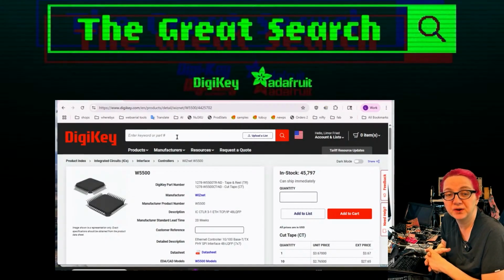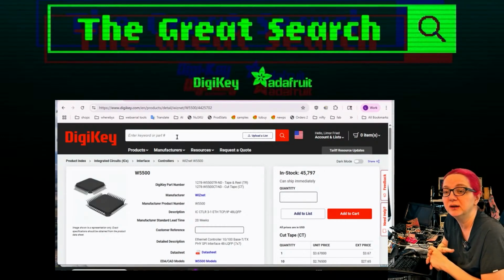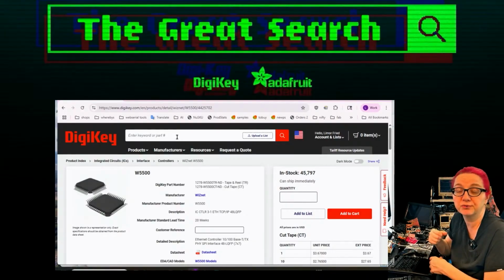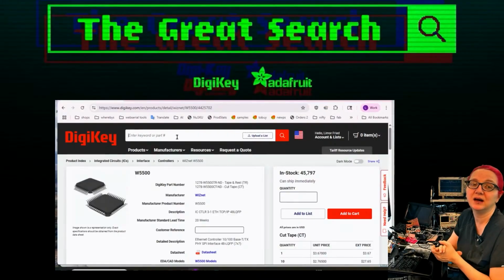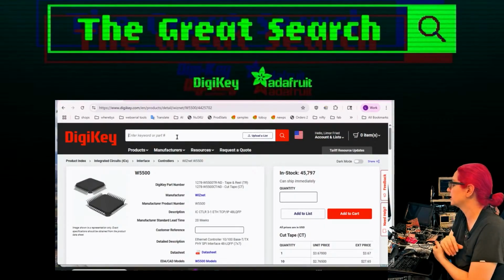Yay. So we have PoE pulled into every room, and then we have PoE routers, wall-mounted routers in every room. If you want to add PoE sensors and stuff, it's really, really easy. So I do get it. It's really nice, especially if you want to have something that's like 50 feet away. You don't have to pull a power cord 50 feet, because with Ethernet you can get 50, 100 feet so easily, as long as you're not using more than a couple watts. And most of these IoT sensors aren't. You're good to go. Very common with cameras.